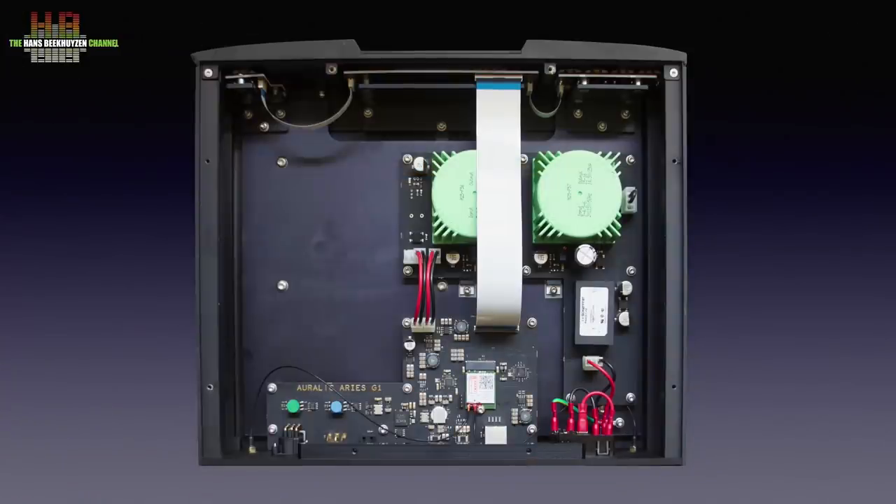The inside shows more of the quest for audio quality. The unit is opened from the bottom, so almost all components you see are mounted against a heavy metal plate that is screwed against the top of the housing. That metal plate is as dead as a dodo — I suppose it is dampened in some way. The large printed circuit board on the right takes care of the power. From there the mains passes a filter and then is sent to two power supplies with toroidal transformers, one for the digital audio part and one for all other logic circuits.